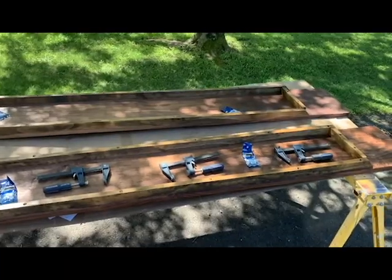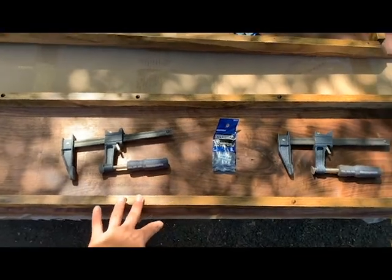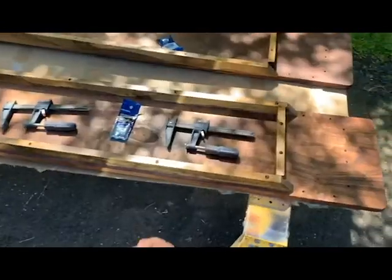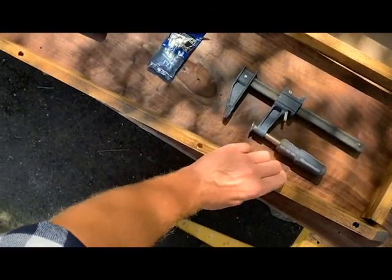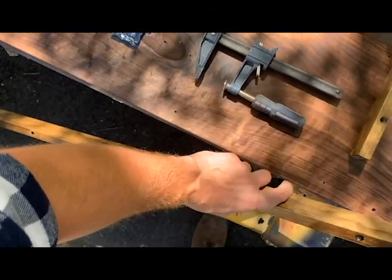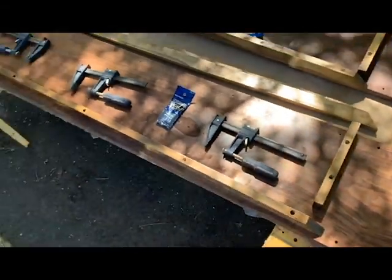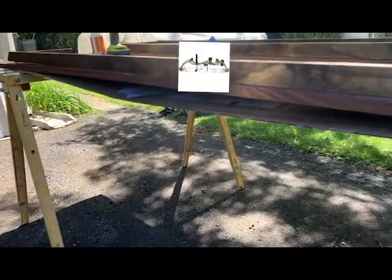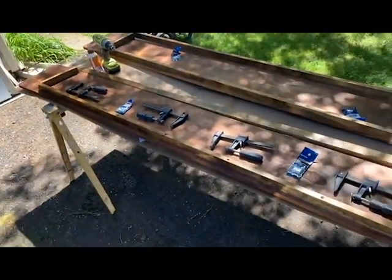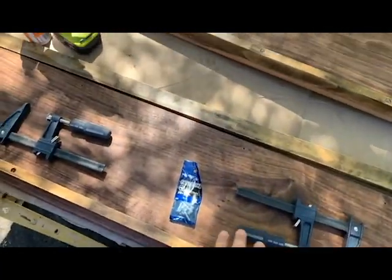So we have just a couple more things to do on the boards here. I have everything finished being stained and I have the boards oiled. I'm gonna lay some glue on the underside of these guys and clamp them down so they are fastened nice and securely against, I almost dropped it, whoops, against the bottom of these boards to give them a little support. There is a little bit of a bow in this piece right here, but I think we can fix that just by screwing and gluing, clamping and all that. And I've got my screws here, got my clamps, and I got my glue.